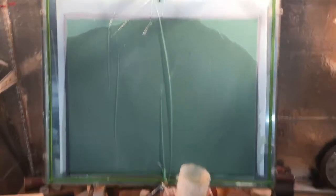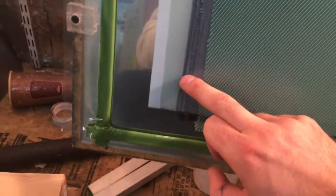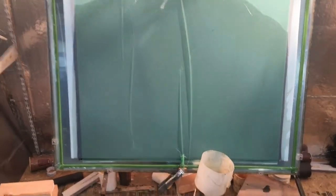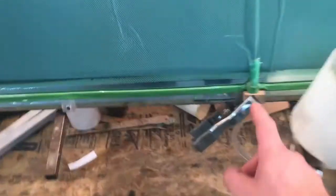We're getting close to done and this is a good example of the resin break — you can see how the epoxy made it up and is bleeding through the fabric a little bit, but it's allowing the corners to kind of catch up. Even though the epoxy made it all the way through the carbon, you can see how it's having trouble making it through the peel ply — that's what a resin break does. We're about a half hour in, which is a little time-consuming. It's chilly in the shop today so that slowed it up. We could speed it up using some spiral wrap, which really opens up the inlet line and allows it to pull through much faster.